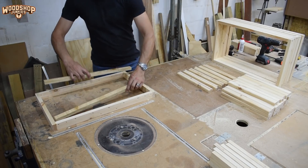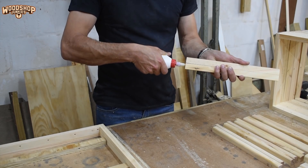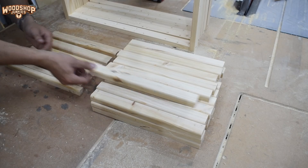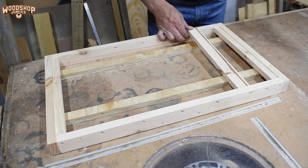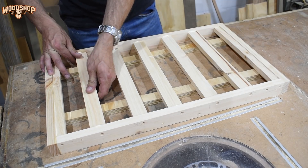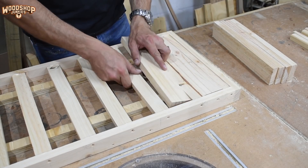To install the drawer slats, I placed the drawer frame upside down with spacer blocks inside. On top of the spacer blocks, I placed the drawer slats. For the narrow slats, I only routed one edge because these will be installed on the edges or ends of the drawer and only support a bottle at one side. There will then be five wide slats that will support a bottle at both ends, for a total of six bottles per drawer. To ensure that these slats are installed with a uniform spacing, I placed spacer blocks between them before fixing them in place.